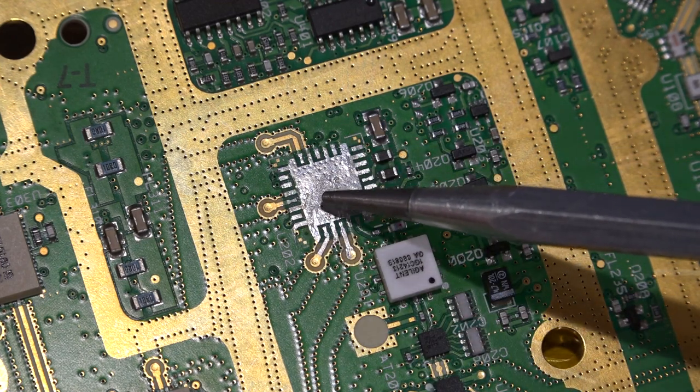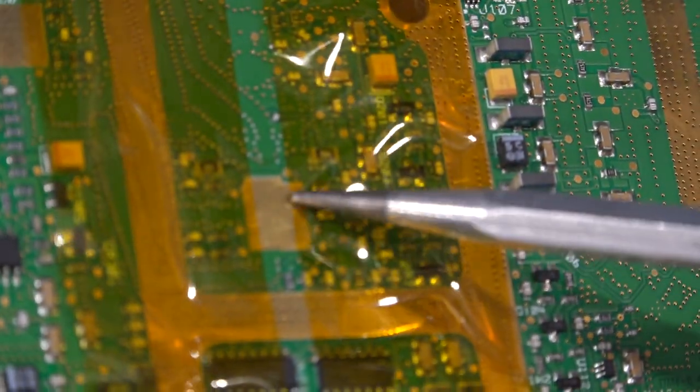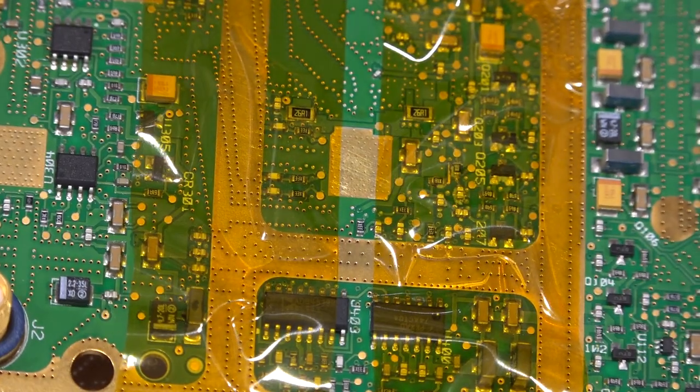The primary purpose of this is actually thermal because it allows the heat from the component to be passed through the board to the other side. You can see we have some thermal vias and an exposed pattern on the other side. This is true for all of the different components that are actually there. A thermal pad is placed on that side which connects to the entire chassis — that's how they take the heat out.